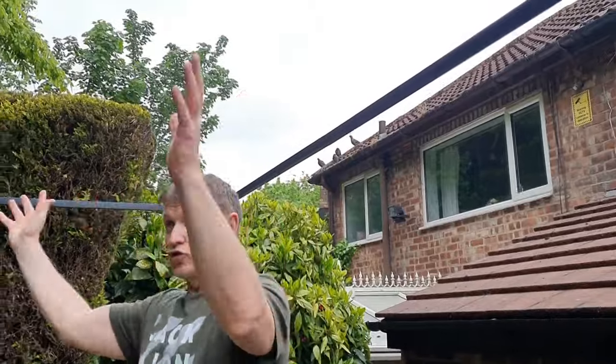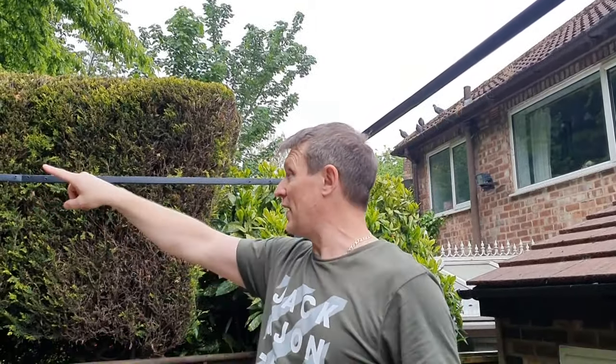Okay, so that's the full structure to the base. So we're going to start anchoring on the little side parts that need to go on here now, and then it'll be the roof after that. Okay, I'm just going to square the base as well. So make sure, before putting the roof up or anything like that, that this is totally square.